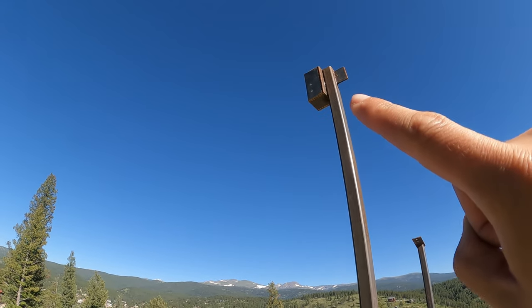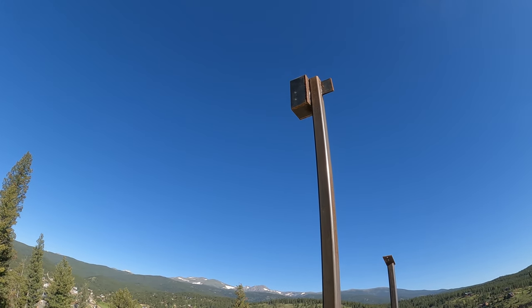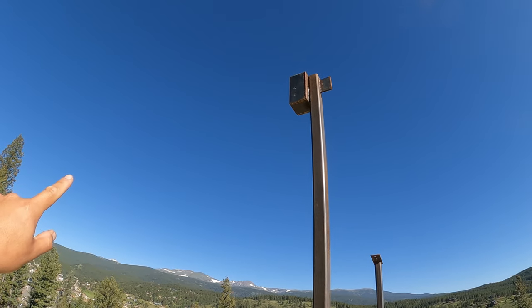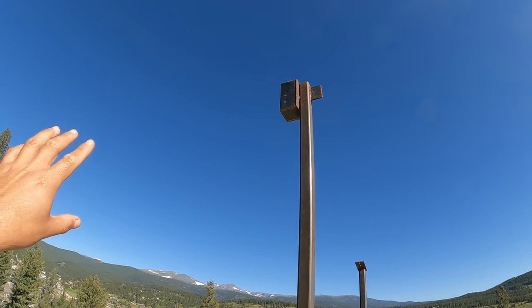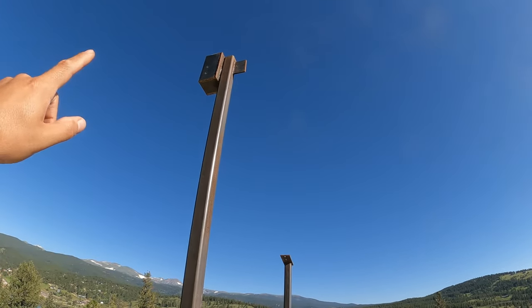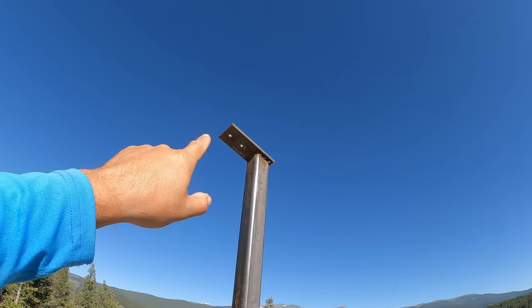He also managed to install that bucket, or connector, I call it. That's where the ridge beam on this side will be, and those will be LVLs, so that makes my life easy because I can do it. He also put that tab that will connect to the ridge beam. From there, we come down at a 4/12 angle.